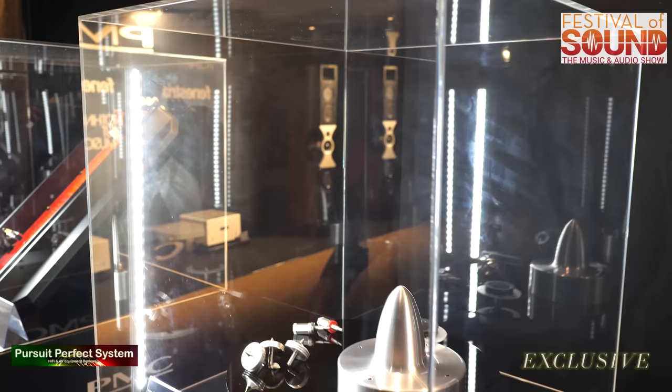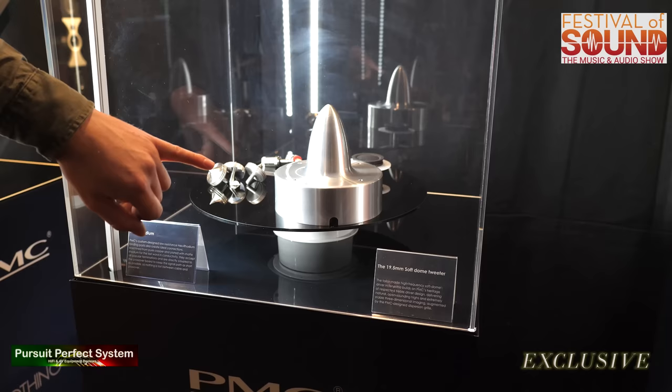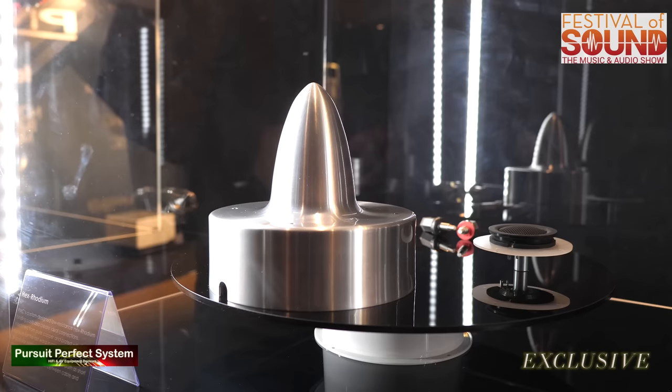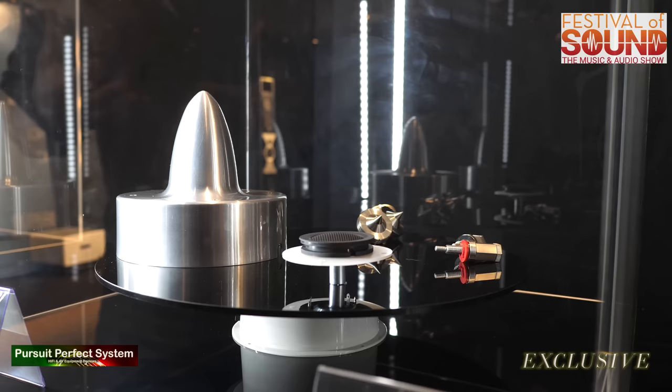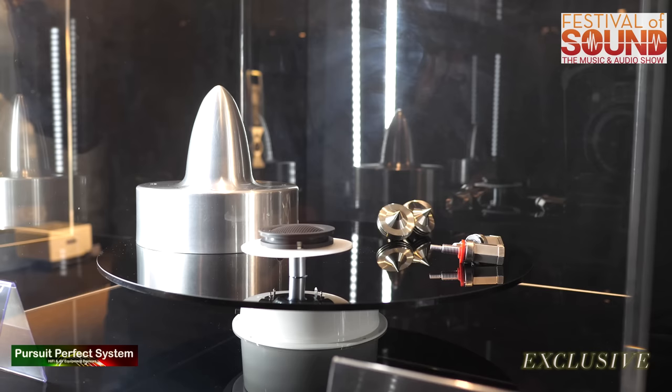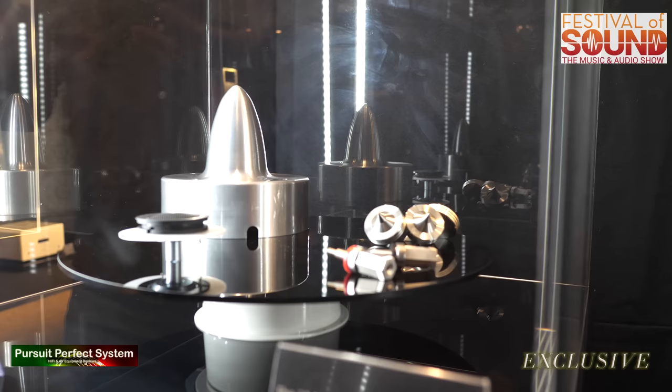These are just various parts showing the metalwork. This is the rear chamber on the mid-range driver. What we've done with the mid-range is we've modified our existing 75mm soft dome mid-range driver, which is a really world-renowned driver — one of the best mid-rangers out there, if not the best in the world. We didn't need it to go quite as loud in this as in some of our larger active speakers. So what we've done is bored through the middle of the pole piece, and that's allowed all the back pressure behind the dome to be released into this chamber. It really opens up the mid-range and gives it a much more airy, detailed sound — a noticeable improvement over what was already a spectacular drive unit.